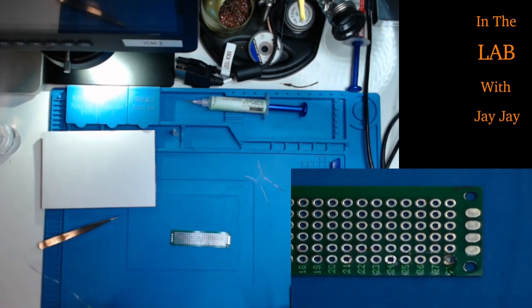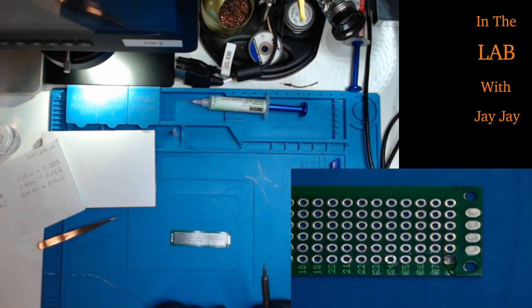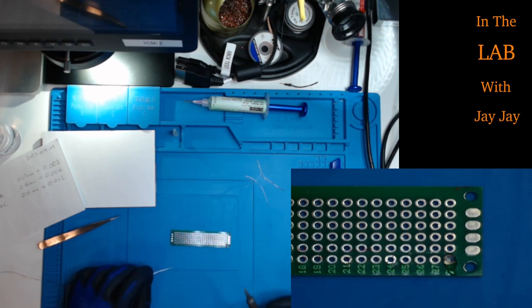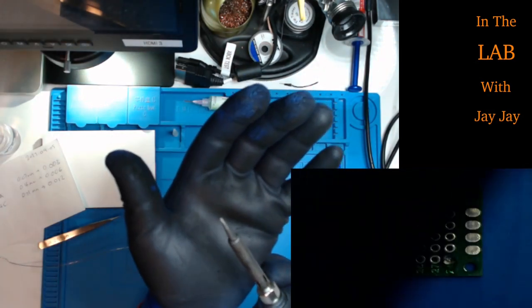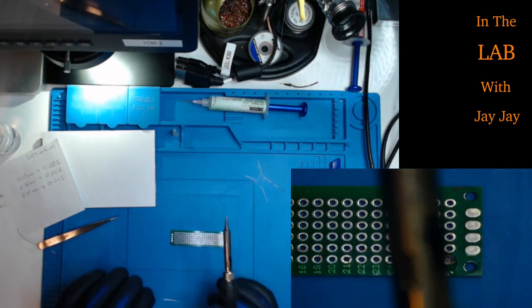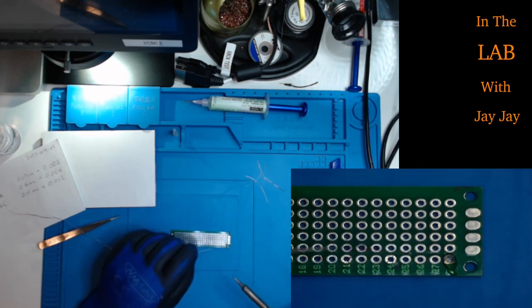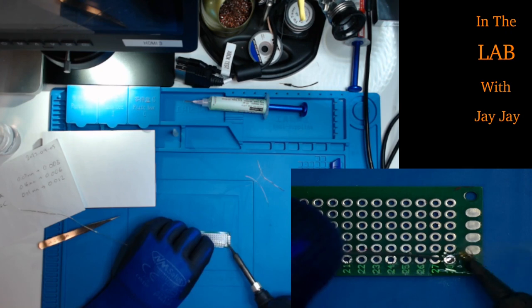And some solder. Now, what did I say we were going to do? We're going to be doing 22A to 21B. Fair enough. Now I'm using a small chisel tip here. Can you see that? Small chisel tip. I've been playing with them lately. I had a go at the bevel tip. I didn't like it as much as the chisel tip. So I'm back on the chisel tip.